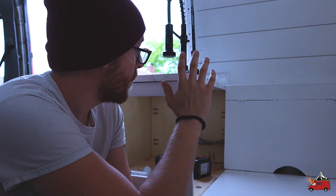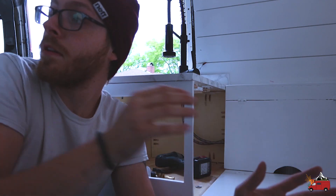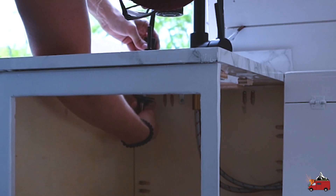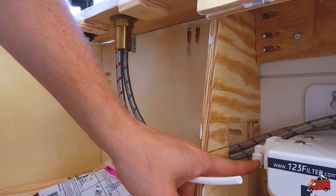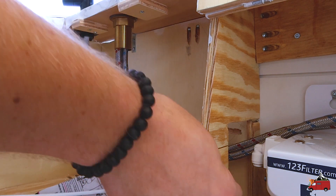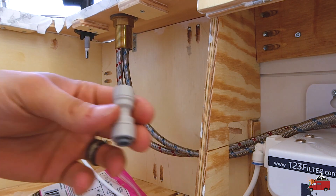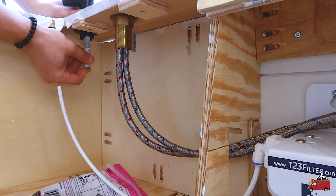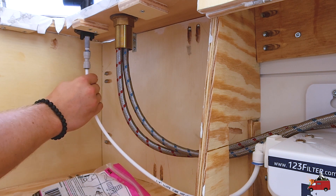It's starting to rain right now so I'm trying to get my move on. I just finished mounting the first faucet — I had to secure our countertop down because it wasn't secured very well, now it's secured. Starting to sprinkle, so I'm going to go ahead and mount our filtered water faucet. The last thing I need to do is connect the tube from the filter through the entry hole and up to the faucet, then put in the little locking clip. I've got the quick connect that came with the water filter tab and I'll insert it here.